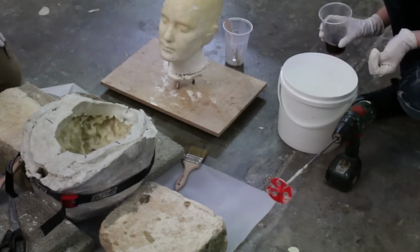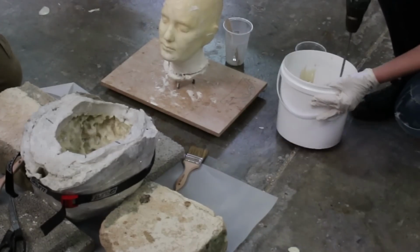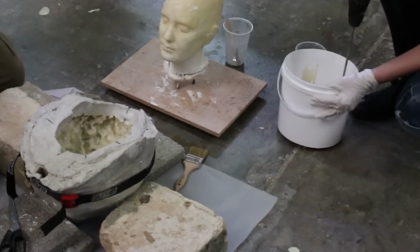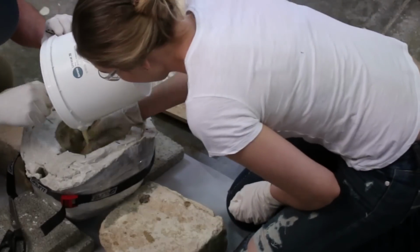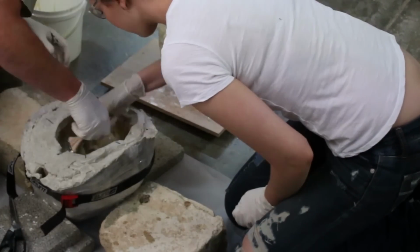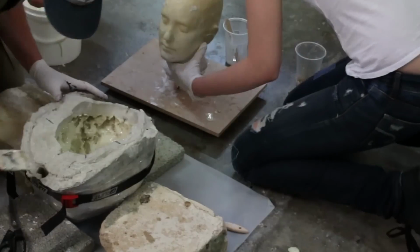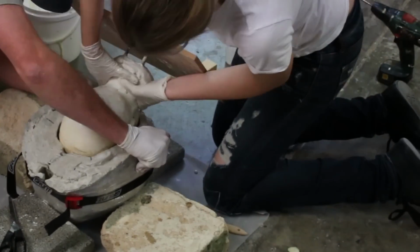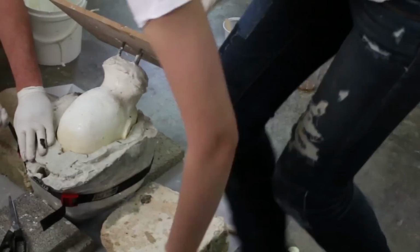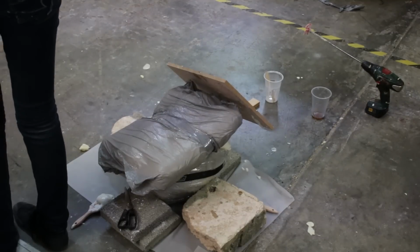Now to pour the foam. This was kind of intense because it has a 7-second mix time and then a 13-second pour time, so you had to be fast. So once I got that mixed, we poured that bad boy into the mold and pushed it into the grooves with chip brushes, and after brushing it in for a couple of seconds, we stretched the mold slightly open to push that face positive back in, then strapped the mold horizontally. We didn't have enough time to strap it vertically, so instead we used myself as a quick way to keep the foam from expanding too far out of the mold and just to keep it denser.